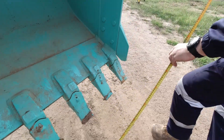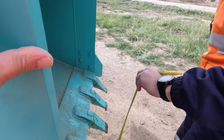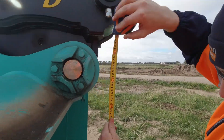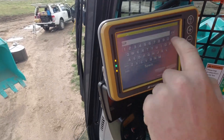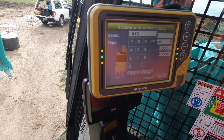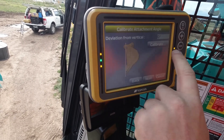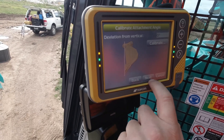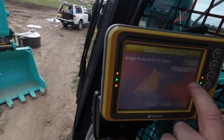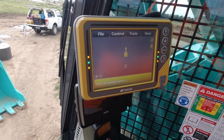So that's 13.30. And 17.24. So we can type in here — we'll go 1300 GP. So this is 1.330 and 1.724. Okay, hit next. So we just plumb that, calibrate. Next — pivot to base. So you lay your bucket flat. Calibrate. Done.